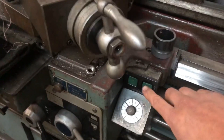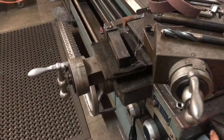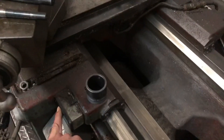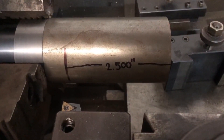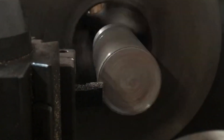Welcome to part two of making a mandrel for resurfacing brake rotors. We're going to be turning both sides of some brake rotors that I've been given so they can hopefully be used as backup or later on if their current set of rotors get warped. The idea is to make two pieces that press together, because I don't have a single big block of six-inch diameter round stock.